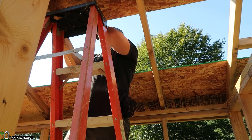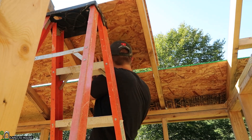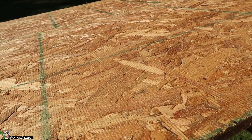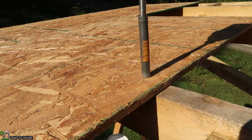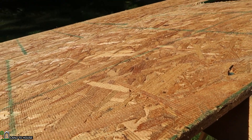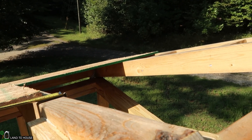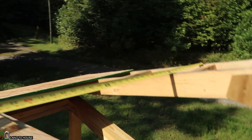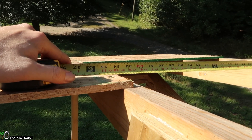I'm going to scoop this all the way to the other end. Up top here, I'm just putting a screw at the top and bottom of each of the trusses — one there, and then one right down here. Now I need to get the distance here on the last gap to see what that's going to be. Looks like 34 inches ought to do it.